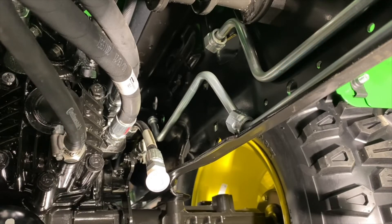Next, we're going to be installing the hoses. There is a note: the short hose should be placed along the frame rail as shown. Hold tubes and hoses against the frame rail when tightening, and keep routing as close to the frame rail as possible. It helps prevent interference when installing brake and differential lock rods. Step 22: raise the rod end of the cylinder upward to aid in installation of the large elbow fitting to the hydraulic line. Step 23: connect the large 90-degree elbow fitting on the short hydraulic hose to the rear hydraulic line and tighten both sides.